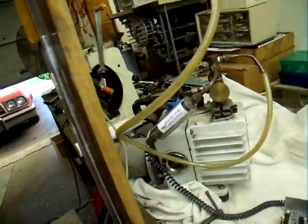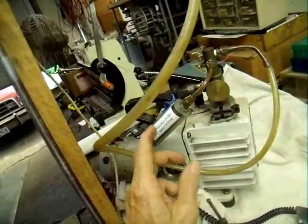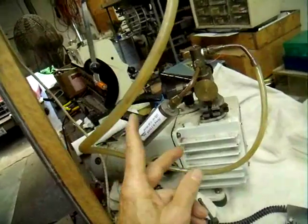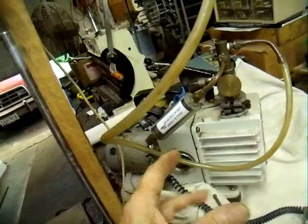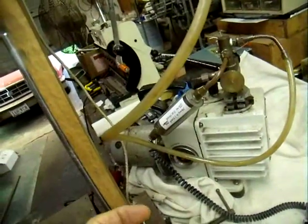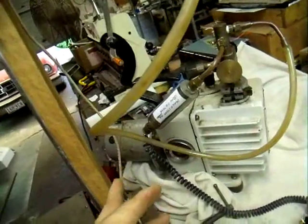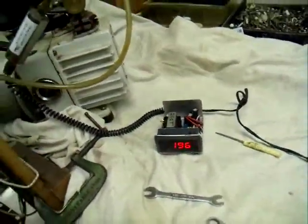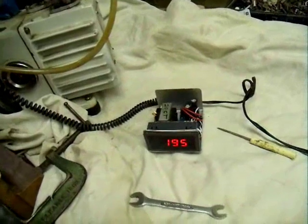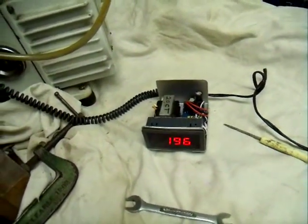That's all you can expect from this type of manometer. A manometer that reads from 1 torr to 1000 torr gives you three decades of measurement: 1000 down to 100 is the first decade, 100 down to 10 is the second, and 10 down to 1 is the third. You cannot expect it to go lower than that — the linearity simply isn't there. So we now have a digital gauge completely suitable for measuring pressure from 1 torr to 200 torr.